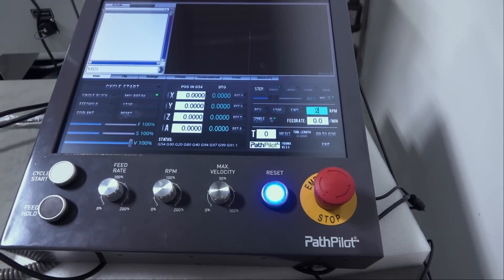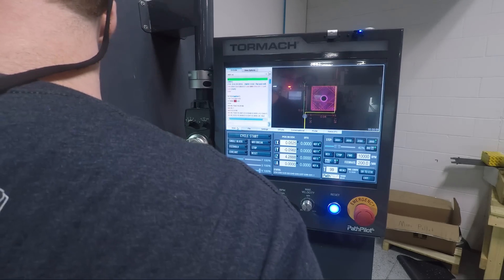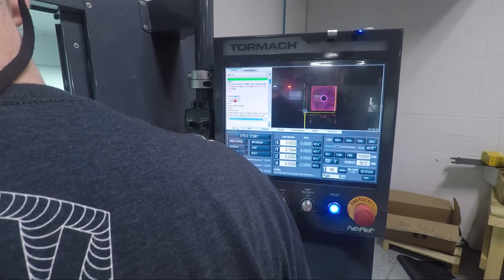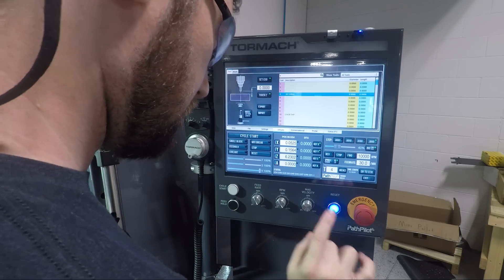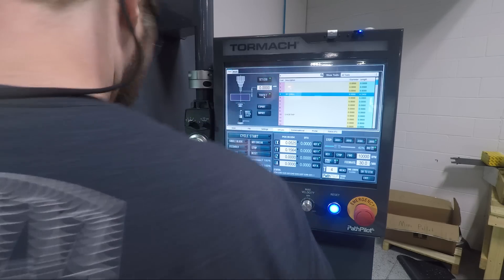In terms of options we did go with, the Pathpilot control panel has been great. It's a little pricey at around $1,800, but having the screen mounted at this orientation with physical knobs and buttons below makes it a lot less jarring to go back and forth between this and all of the other controls we're starting to have around the shop. The knobs for feed rate and spindle RPM overrides make it much easier to feel for that sweet spot if you're getting chatter or if you're trying to determine how far you can push a recipe. The operator console does include several big-ticket items that you would otherwise have to buy anyway, like the control computer and touch screen, so with that taken into account it's really not that bad for the upgrade you get.